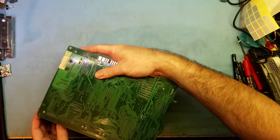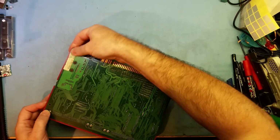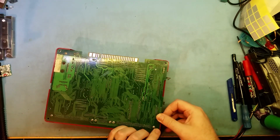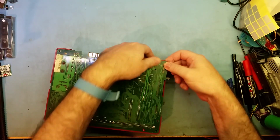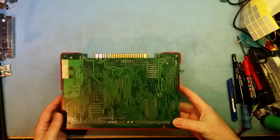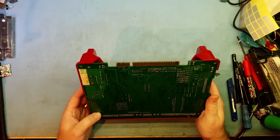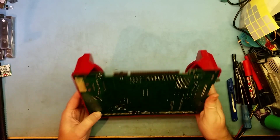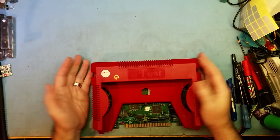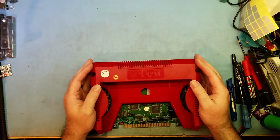Now, Revision 9 still had the rechargeable battery. On the later ones, they go to a coin cell. But what some people do is they just grab a coin cell, take the battery off, and then put a coin cell holder right where the rechargeable battery was. Now, it may fit, but it's not going to work properly because the motherboard is still trying to charge that battery, even though the coin cell is a non-rechargeable battery. So you can actually end up blowing the batteries up.